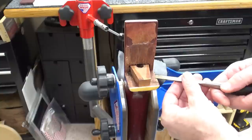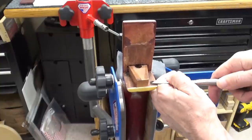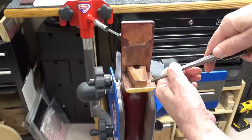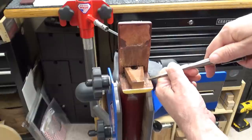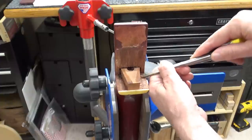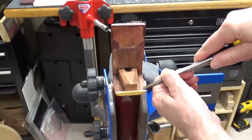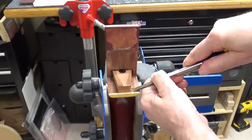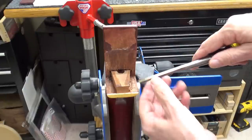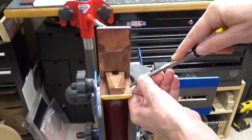Now I'll start preparing the heel. I like to use this quarter-inch chisel. I've got it held nicely in this Total Vise Number Seven. There's a bit of glue and stuff still present, so I'm cleaning that up as I go. It already has kind of an undercut shape to it back there. We'll be leaving the whole perimeter as it is for now, and then I'll show you how I calculate how much material I'm going to remove from that perimeter.